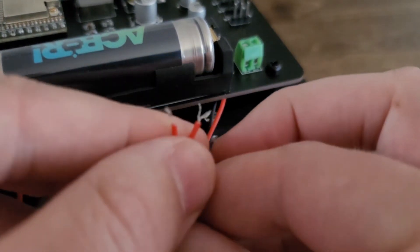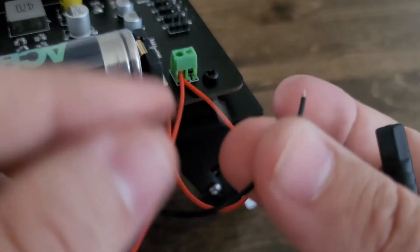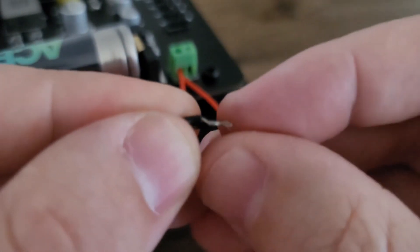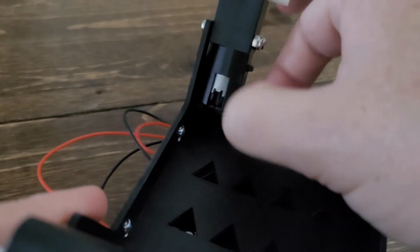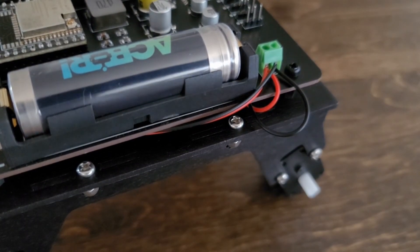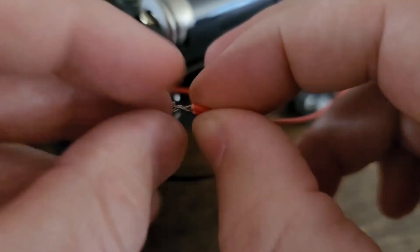Next, we'll wire up the motors. The first step is taking both red wires and attaching them to the back portion of the screw block terminal — the green plastic component you see here — for the right side of the robot. Then do the same with the black wires. If you're having trouble getting the wire in, be sure to loosen the screw block terminal with the flathead screw on top. You can tighten it using that same flathead screw. Once the first side is connected, pull the wires back a little to keep things organized. For the left side, the wiring is the exact opposite: take the red wires and connect them to the front of the screw block terminal, then the black wires to the back.